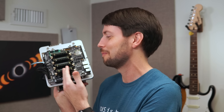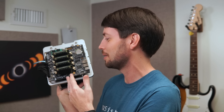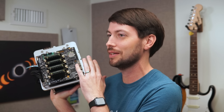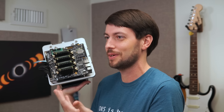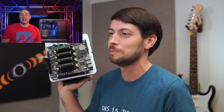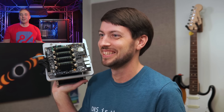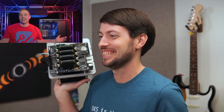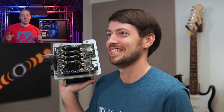It has a SATA board, and right now I just have one two-terabyte SSD plugged in for storage for the cluster. My eventual goal is to maybe run some websites or other things using Kubernetes, so I'll probably put another drive on there and have them in RAID 1 for redundancy. The big board itself is a Turing Pi 2, which comes out in probably a month or two. This is an early prototype — there are a few hardware bugs I'm helping them fix, and the firmware is nowhere near complete, but it boots up these four Pis and has a management backplane.